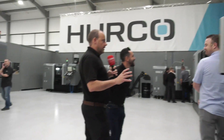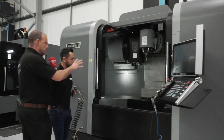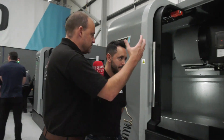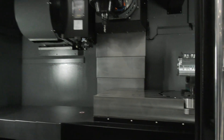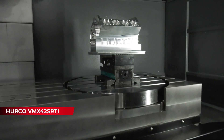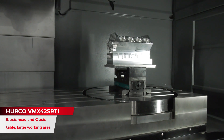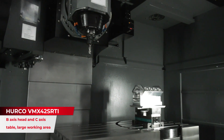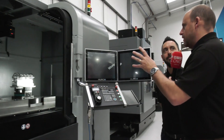Now we want to look at this style next. As I look at each one I'm impressed, but things stand out to me straight away as advantages with the different setups. Here, for example, with this head and the integrated table, I look at this machine and think: I have got a standard three-axis machining centre where I can load a quantity of batch components, load a large plate, do all of these different things — as well as then going, oh, and there's a five-axis job I can attack that as well. For me, this is as flexible as you can get with a five-axis solution.